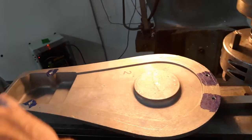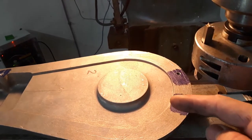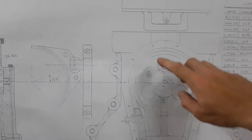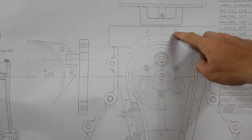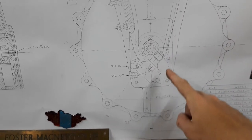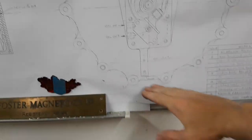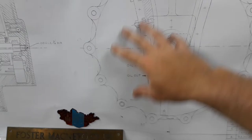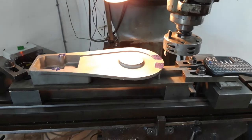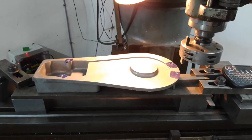The reason I'm coming off the job before I raise it is that's going to leave potentially a very small line. I could have done that at anywhere around this point, but if there is a small line here that's giving us a potential for an oil leak — and that line in the engine is going to be across there — there's less chance of oil leaking from here if there's any problem than if that line was across here, because the oil level is down here and this would be a lot wetter than at the top. So I think that's good to go. All I've got to do now is change the G-code to slow down the feed rate and we'll take a cut.